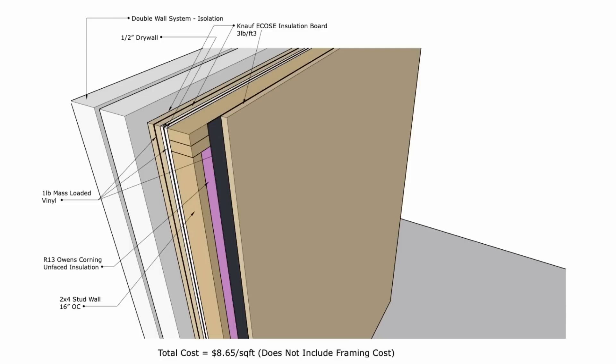Looking at this diagram I made in SketchUp, this shows what you would do if you were creating this wall in your studio. This could be turned into an acoustic panel as well, but in Philip Newell's designs, this is the wall design for all four walls of his live room, or three walls of the control room. He usually likes to use the front wall as a solid concrete or stone wall where he flush-mounts the speakers. This wall is the absorption acoustic wall in all of his studio designs.